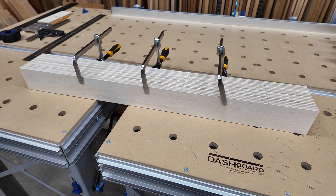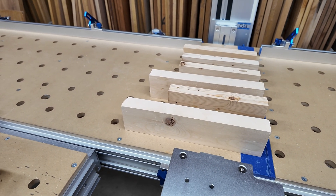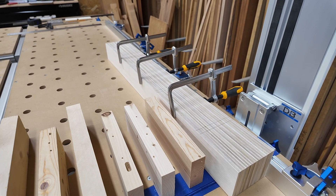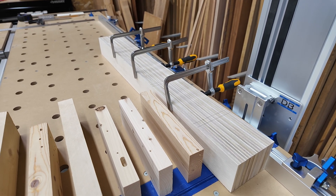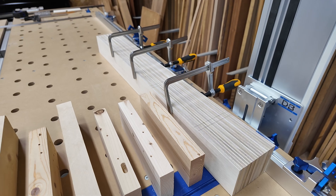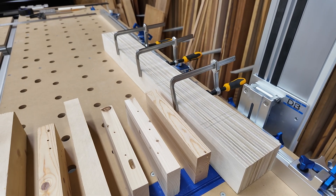These ribs are 73 millimeters wide, and I've cut myself a set of 73 millimeter support boards so that I have plenty of support under the guide rail. I've got the guide rail bracket for my track saw set up at approximately its full height — its capacity is said to be 74 millimeters. I cut these web pieces to 73. I'm holding my gang of boards together with three clamps so that at any given time I can take one off and still have two left, since one will be in the way of the guide rail.